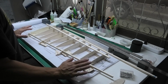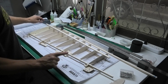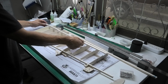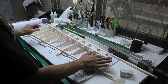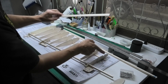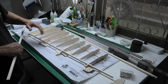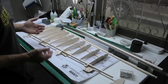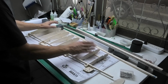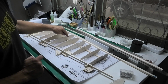So okay, we've got the jigs in place, I've got this trailing edge in place. This lower spar here, I then pin that in place. It's a little bit too long either end, which is good because it allows me to put some hefty pins into that at either end and not worry about damaging or putting big holes. Not that it would make any difference, probably. I then made sure that that is straight as well and lined up, and I put in some smaller, finer pins.